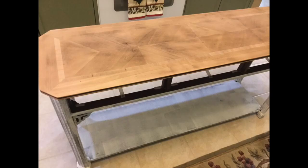I went ahead and brought my table inside and as you can see I started painting the bottom shelf. Now when using chalk paint there is no prep involved — just make sure that your wood is free of dirt or any dust. I'm going to give it several coats of paint to cover up the wood finish. When it's all done drying I will use a 220 grit sandpaper to give it a nice smooth finish and then seal it with a polyacrylic clear coat.